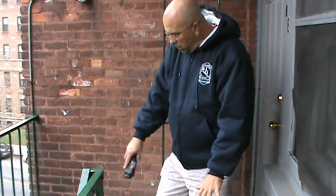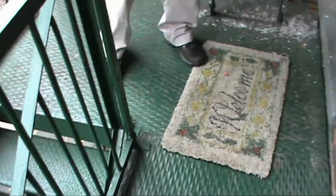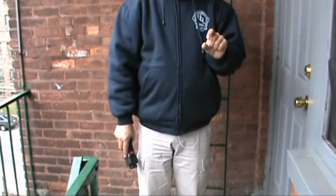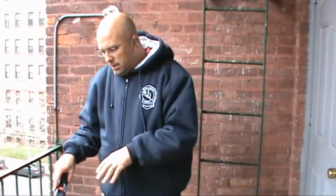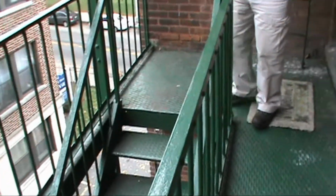First of all, we have an existing fire escape that we're looking for evidence of maintenance. We've got nothing but original hardware throughout the fire escape on the bolted connections. But we do have evidence of maintenance: below all this diamond plate and all of these stairs, it's new diamond plate stairs and new diamond plate platforms on top of pre-existing steel plate platforms. So the plates stayed and they just put this over it. All the treads are new diamond plate, but they stayed over existing clips. So we're going to cover all that in a second.